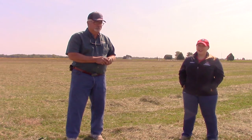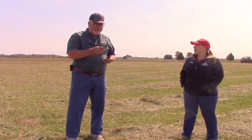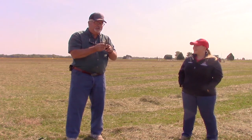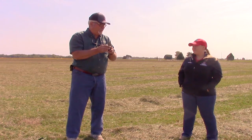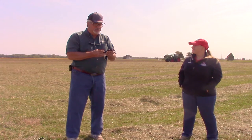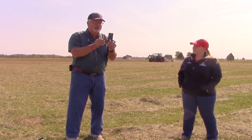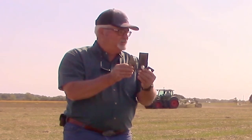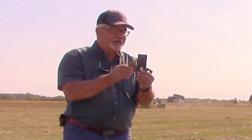Another important thing is having good sharp knives on your cutter bar. Brent brought a cutting knife off a machine that was actually running, and you can see the guy had some issues with streaking and was complaining about the quality of the cut. Just by comparing the two knives, you can see what the difference was — no wonder it wouldn't cut.